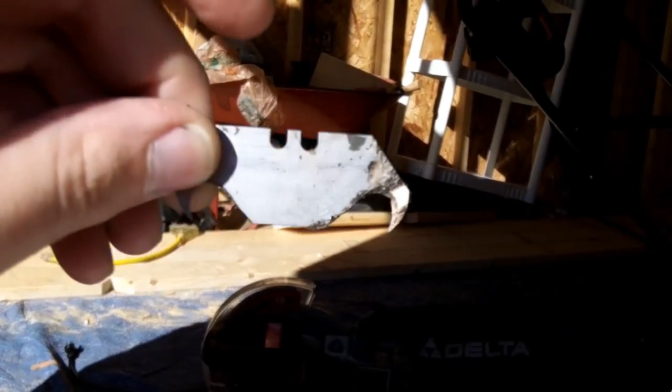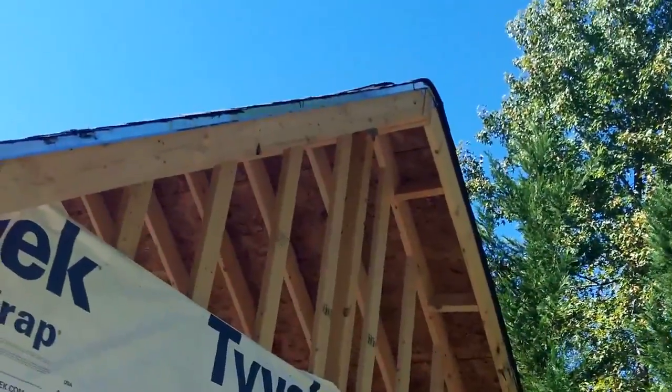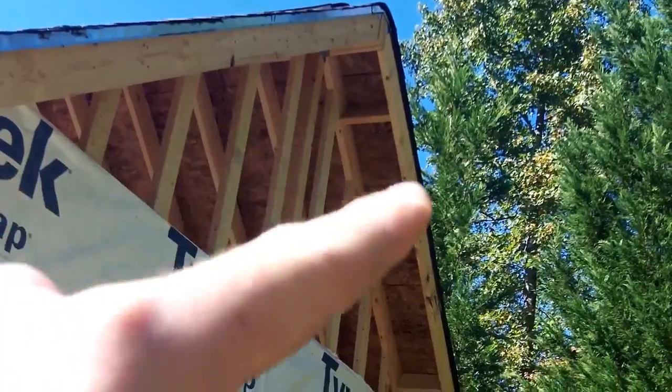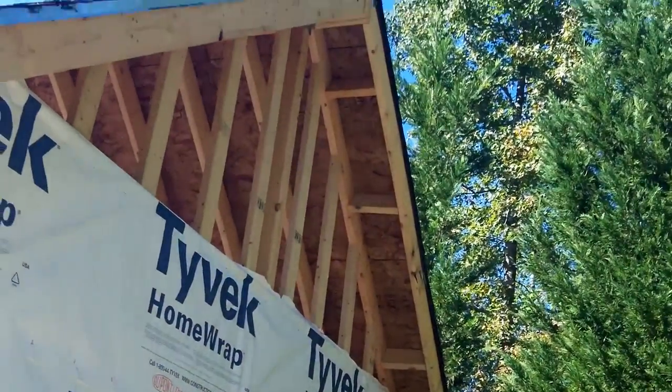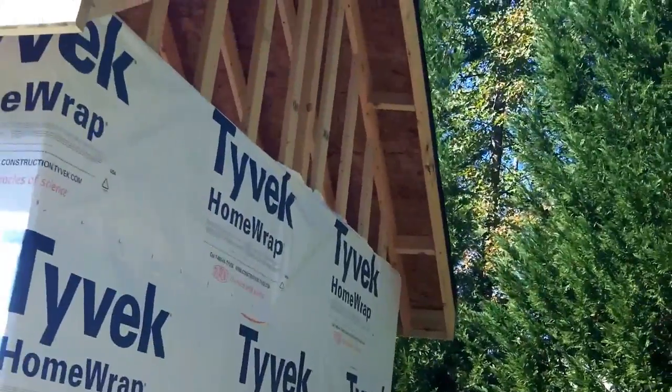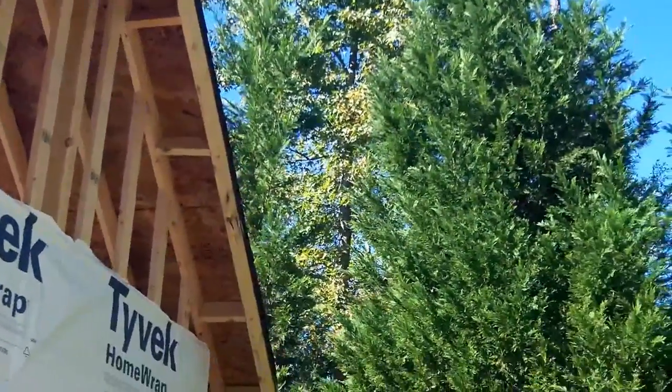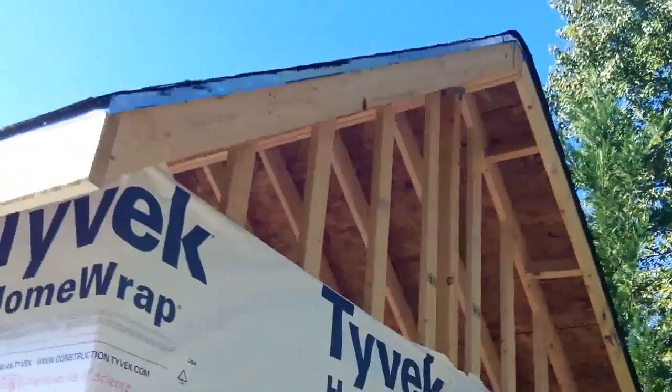You just have to go through with a shingle blade and cut the overhang. This blade is invaluable — regular razor blades don't work very well, but this one cuts through shingles like butter, especially when they're warm from the noonday sun. Also, from last time, I put some blocks in to stabilize these rafters on the outside — they were a little jiggly since they don't rest on the wall. The spacing isn't very important, I just needed to get them stable, and that worked.